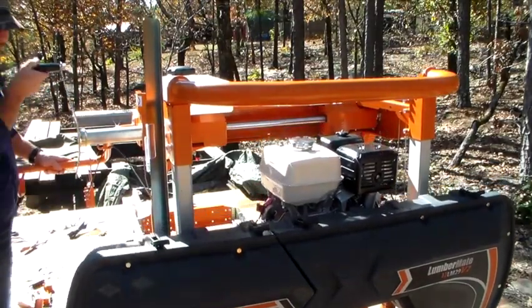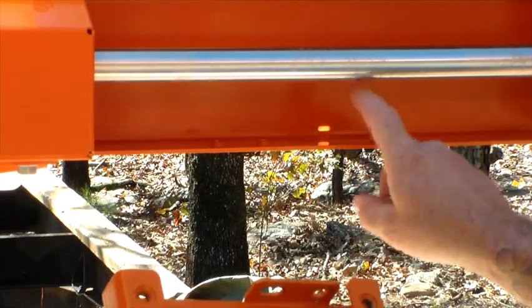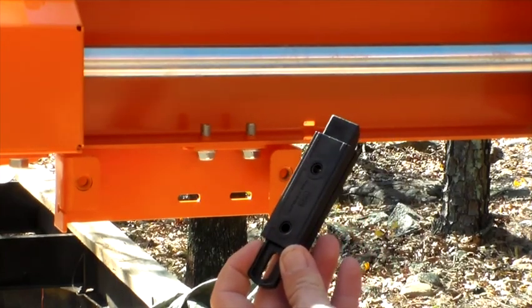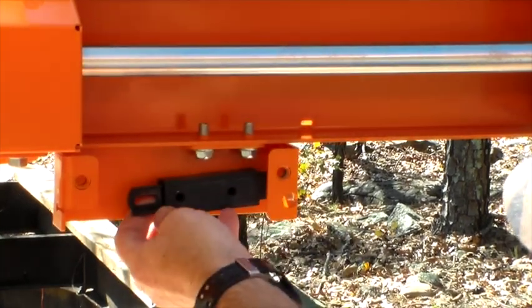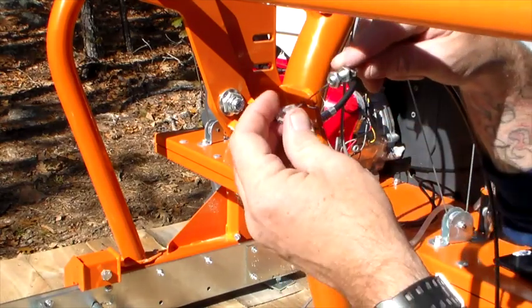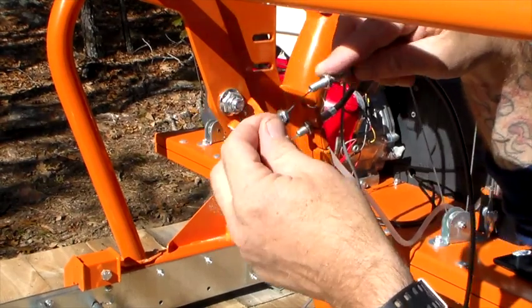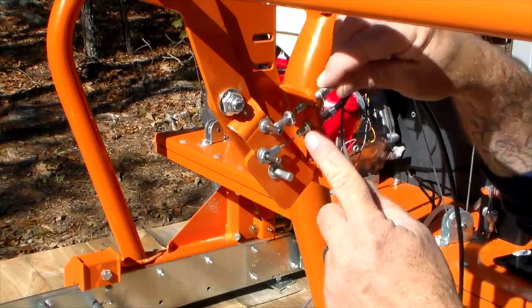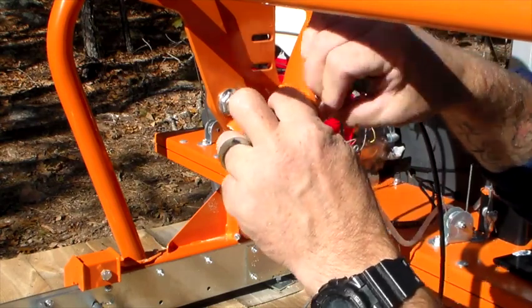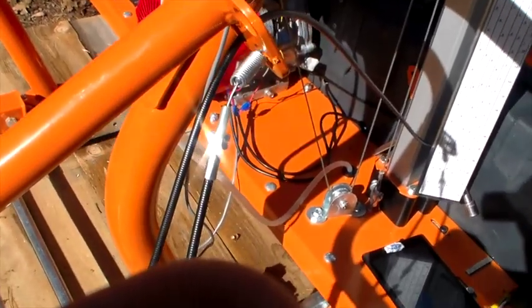The first thing you want to do is lower your saw head. Next you want to take your water valve bracket and mount that on the underside of your horizontal winch cover. The next thing is going to be your on and off slam latch actuator — you're going to put it right here and go to your extreme right, and we're going to use the machine screws to put that on. Then take your throttle cable that they provide, slip your locking nut off, and slip the cable through the slot on the very top — we're going to use the top slot. You want your nuts to be about halfway on the threaded part.